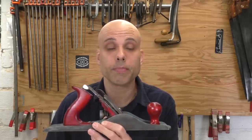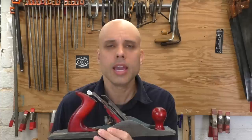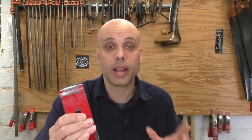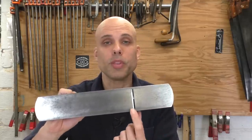To make this build even simpler, I'm going to do the whole thing with a single hand plane — a Stanley Victor number five. The Victor was a lower-cost budget line that Stanley put out in the 1940s; they're still very good and less expensive than a normal Stanley plane. To make it more versatile I'm going to use a pair of irons: one with a big aggressive curvature for heavy stock removal and dimensioning, and another that's more like a smoothing plane iron — mostly straight with just a little curvature. The Victor has a pretty wide mouth, more of a carpentry plane.